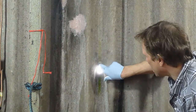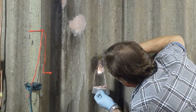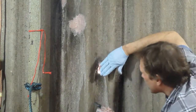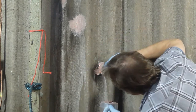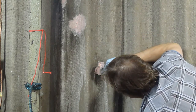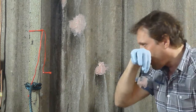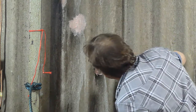That's the hole from the other side. You can see we've got tape there. Now, being a little bit gentle, we're going to fill this up. If I spread a little bit of material either side, that's not a problem because that will help strengthen it. Now, of course, I'm doing a repair on some corrugated here, but there's a whole variety of applications for this. You might have a hole in your roof, and as long as there's a good key there, then this will stick on.